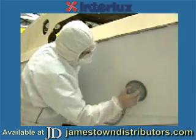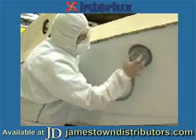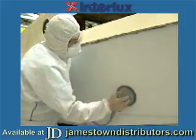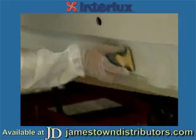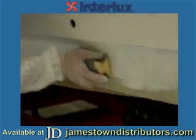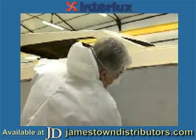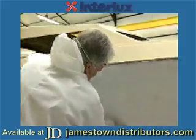Now you are ready to use your dual action or orbital sander again on the undercoat or primed surface using 220 grit sandpaper. Hand sand over the remaining areas with 220 to 320 grit sandpaper and the sanding block. Finally, dust off the hull thoroughly, giving a final wipe down using Interlux brushing thinner 2333N.